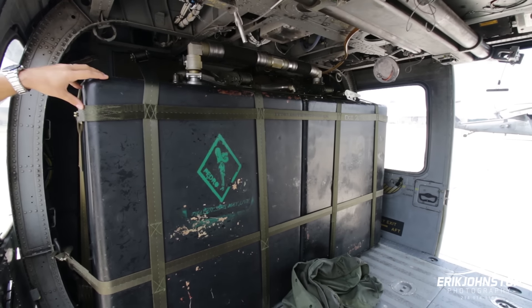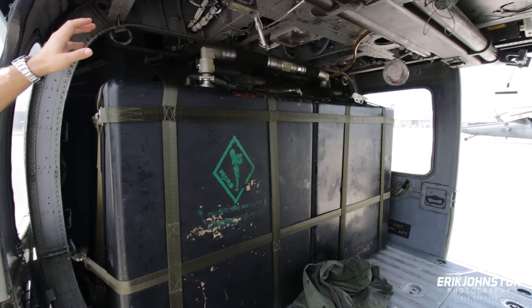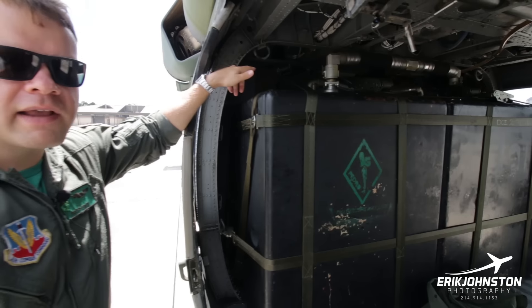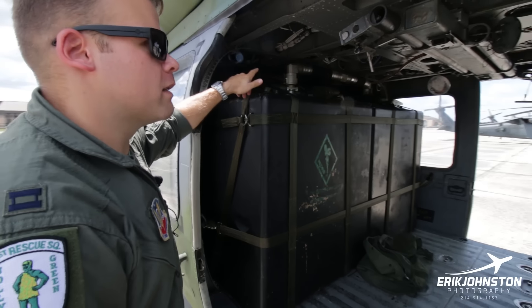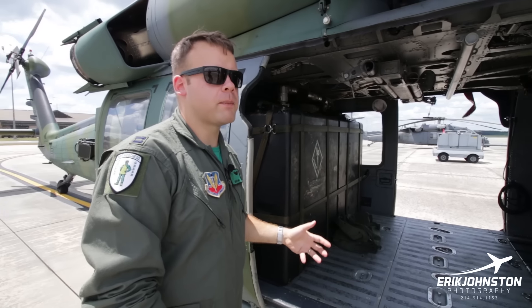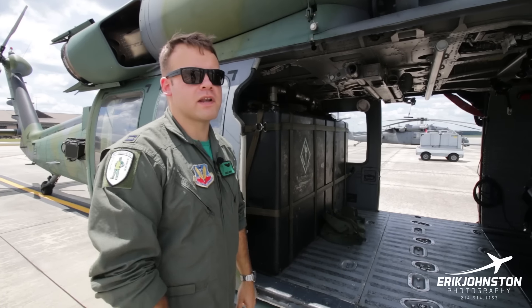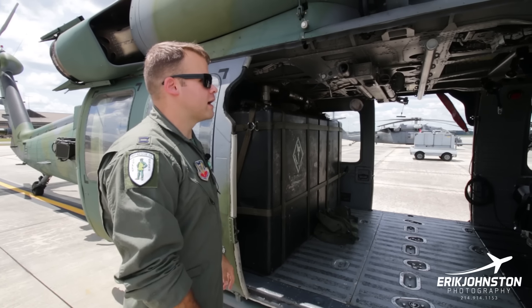These are tied into the main fuel cells that come with any Blackhawk, and they have transfer pumps. When we fill them up, those pumps transfer fuel into the main tanks, and the engines burn it out of the main tanks. The only downfall is that if a transfer pump goes bad and you have fuel in those tanks, it becomes trapped weight — you can't burn it directly out of the aux tanks.